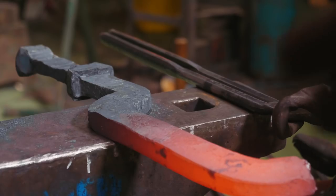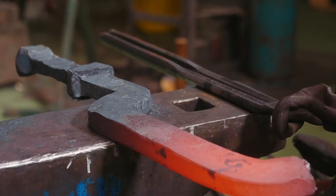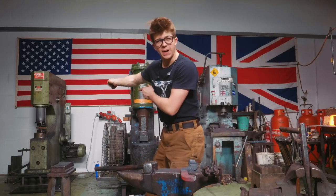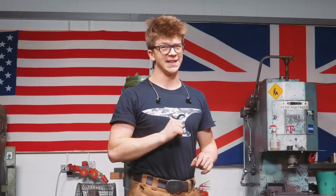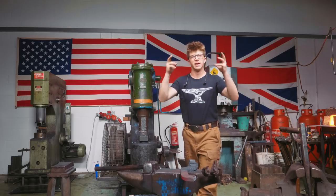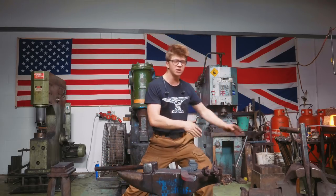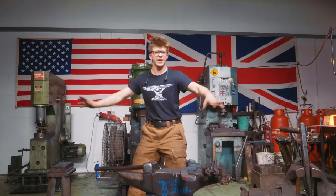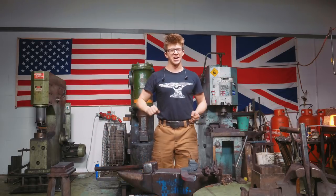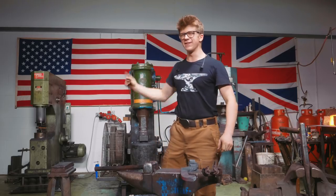We got that little nub forged up, but as you can see, it is very thick and very short in length. What we're gonna go ahead and do to fix that is we are gonna run to the power hammer. Don't run the kopeshes, kids. And we are gonna draw it down. That's gonna be reducing the width. And of course, because forging is the process of moving material around as opposed to necessarily just cutting it off of there, that is gonna lengthen it. Gee whiz, I'm exhausted. Right, into the forge we go.